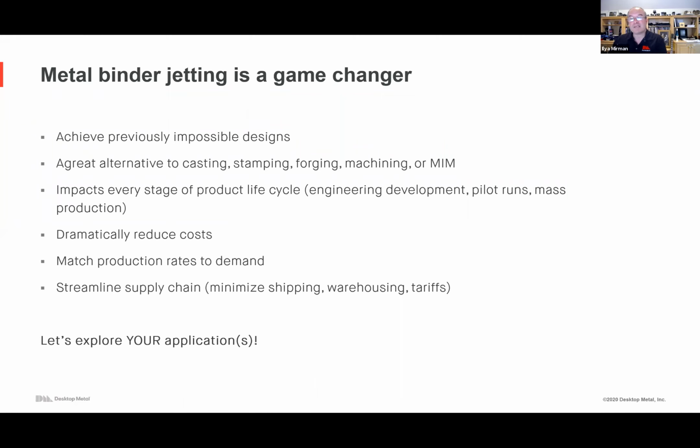You want to make a few dozen parts, 10, 20, 50 parts today, shop system. You want to make hundreds or thousands, then it's the production system. The trade-off is that the production system, all in, is more expensive than the shop system. On the other hand, its throughput is 20 times higher. You can amortize the cost much faster. And so if you need parts that are just a few cents, then your answer is the production system.